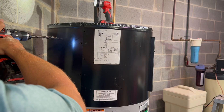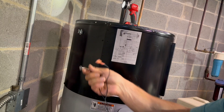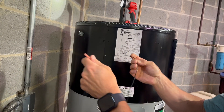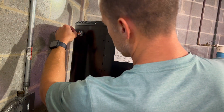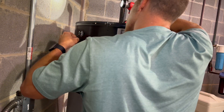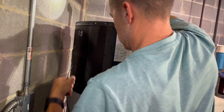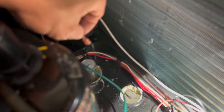With the anode rod secured, you don't have to get it as tight as they put it in the factory — I just snugged it up. Now I have to make a hole for the little electrical line. I drilled the hole on the side and put a little electrical connector in there so there are no sharp edges. There was really no way to fish that wire into my hot water heater otherwise. If you have a different hot water heater it's going to be so much easier because the top will be accessible.